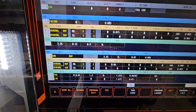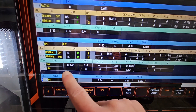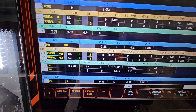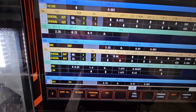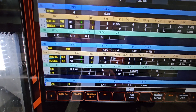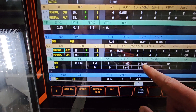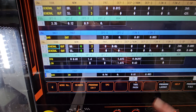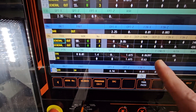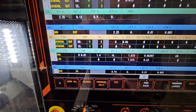Roughing, roughing, finish, and finish. Facing from 235, OD turning from 225. And as you see the taper — instead of going 1 inch and 420, I'm going 1 inch at 400, so that minimum. I throw a little bit of radius. 1.615 is going to be my final — for the drawing it should be 1.634. And for the Z, I just press the question mark, put in a 60-degree angle, then use the calculate option, and that calculates your Z for you. With that 1.615 value, I'm going 600 thousandths deep.